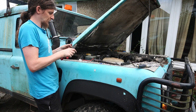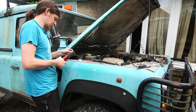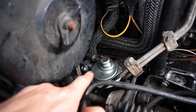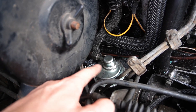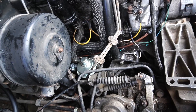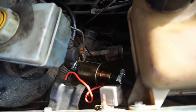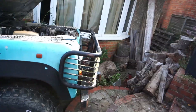Apart from putting one other switch in for the lights, these are the last terminations. After a lot of trying to bleed the system, it turns out the top one takes the fuel out of the tank and the bottom one supplies the engine. It's important to get these the right way around, otherwise it tries to suck fuel out of the engine. So fuel goes to here, goes into this one, then all the way past the expansion tank into the fuel filter and into the engine. I can turn this one on before turning the engine on, which means the whole system is primed and ready to go.